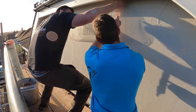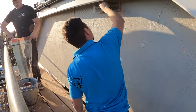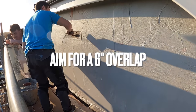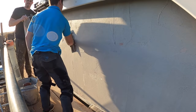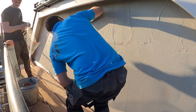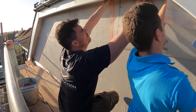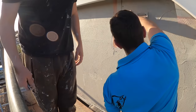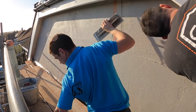We are going to add two coats of this base coat. For now we're just adding a tight coat to get the mesh on — this is why it works so well with two people. I'm troweling it off while Charlie's working ahead cutting the lengths and getting them in place. What I did there is I scored a line into the base coat — you want a six-inch overlap on the mesh, six inches either side. Anywhere there's new mesh applied, you want six inches overlap to the old piece. That allows for expansion and stops any cracks. If you score a line, you know exactly where you stand and where the six-inch overlap is.